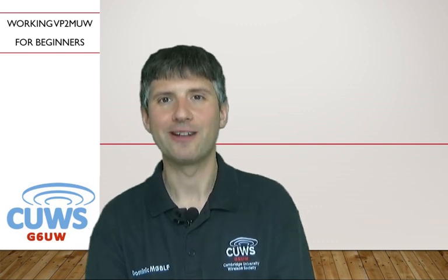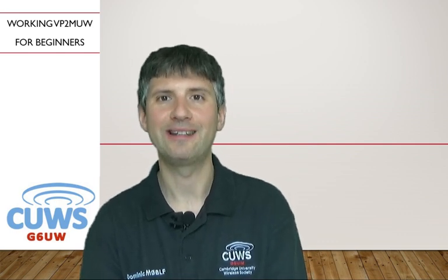So you've tuned your radio to the right frequency and you can hear us. Great. Time to work us, but first of all, spend a couple minutes listening for our operating style. In particular, at the end of a contact, you're listening for what we say. Do we simply say QRZ? Or do we say something like up 5? If we say up 5 or maybe up 5 to 10, then you're going to need to put your radio into split frequency mode. If not, you can start making the contact.